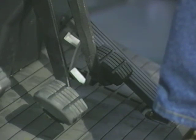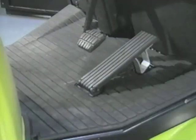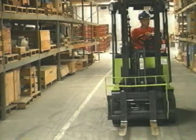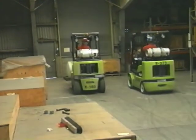There are several different types of control pedal arrangements on IC trucks — read the operator's manual to be familiar with the type on your truck. The most common arrangement is right pedal accelerator, left pedal inching, and center pedal service brake. Other arrangements include: right pedal brake with no left pedal; Unitroll, where the right pedal selects direction and controls speed with a left pedal for inching; and hydrostatic drive with right pedal forward and speed, left pedal reverse and speed. Note that hydrostatic drives feel different than torque converter drives due to dynamic braking.